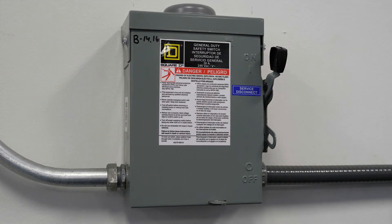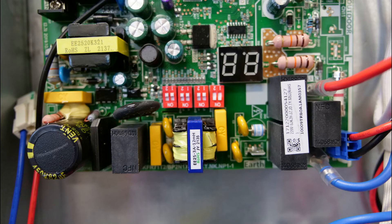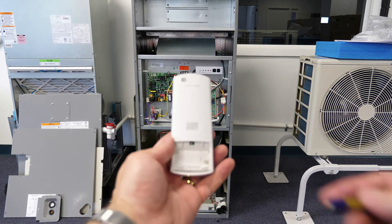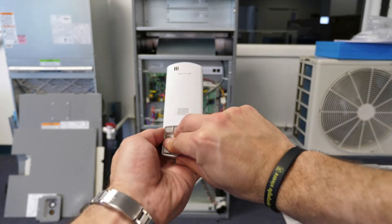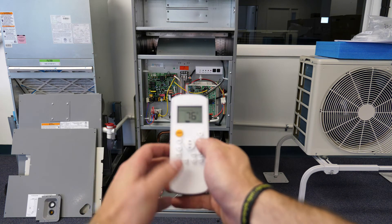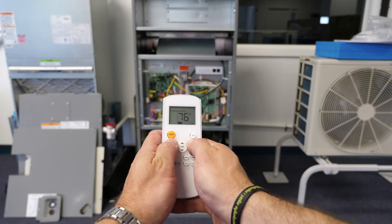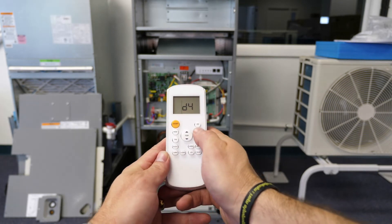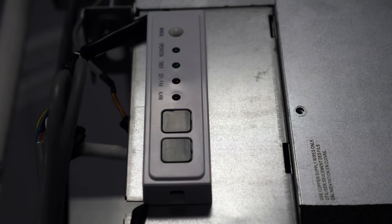Once power has been applied, the technician will have 10 minutes in which to make configuration changes. Ensure that the unit does not have a thermostat call; the display on the control board should read 00. The coil cabinet door should be in place, and the control compartment door should be removed. Next, install the batteries in the remote control — if the batteries are already installed, they should be removed and reinstalled. Hold both the mode and timer buttons simultaneously until F1 is displayed on the remote control. Press the down arrow and the display will change to D1. Point the remote at the wireless receiver in the upper right-hand side of the control compartment and press timer on. The board will beep and display AF. Reinstall the cabinet doors. The unit will run the blower motor for 3-5 minutes and then automatically configure itself. Once the blower motor has stopped running and AF no longer appears on the display, the unit has been configured.